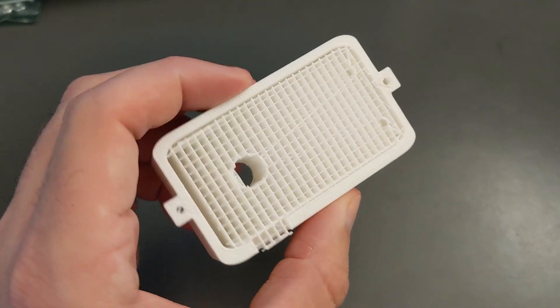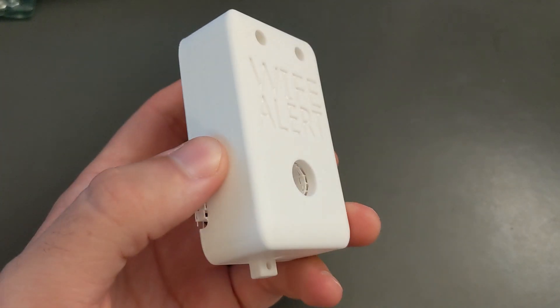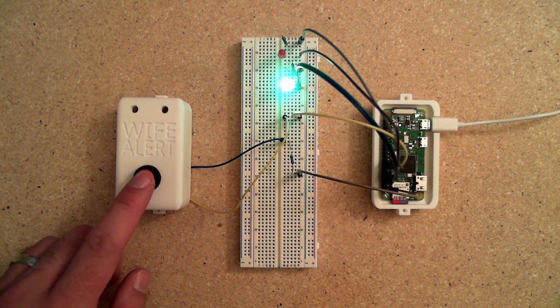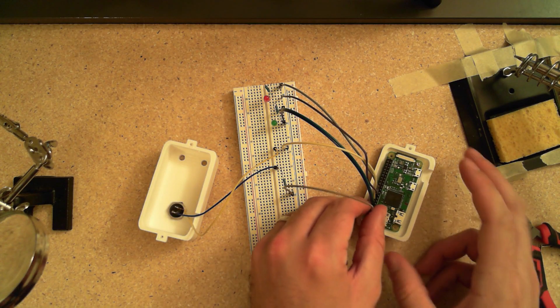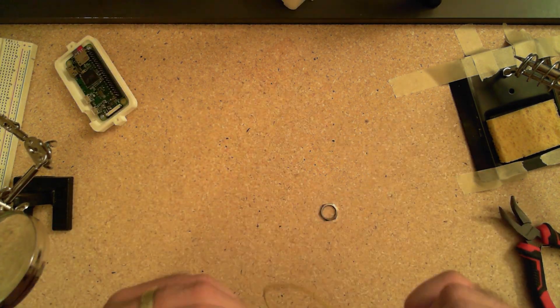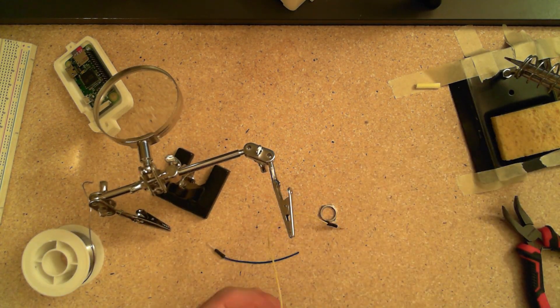The remote's 3D printed and just big enough to fit a Raspberry Pi Zero, the version with headers because I didn't feel like soldering. Its wiring's pretty simple — it's got a big red button that the Pi's script is listening to, and it's got two LEDs that show whether or not the alarm is currently going off. I should point out that the Raspberry Pi is not a requirement here and it's probably overkill; an Arduino would have been a better fit, especially because the startup time on the Pi can be really long and it's hard to get the script on it to run automatically when it starts up reliably. I just didn't have any Arduinos lying around and I had a couple of Pi's.